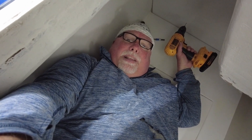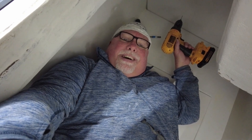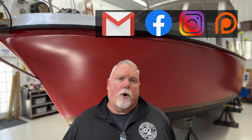All I've got to do now is drill some pilot holes for the small finishing screws that will hold the bulkhead in place. I'm using stainless steel number six, one-inch screws — small and easily hidden by putting in some trim around the edge of the bulkhead. There's not much to show for this project but finally everything is nice and tight, the cheater blocks worked out great — project done. We're making slow progress on my Albin 27 family cruiser, and very soon we'll be completing phase one and moving on to phase two: installing all of the systems inside the pocket trawler. Check out our Facebook page, Instagram, Gmail, and Patreon.